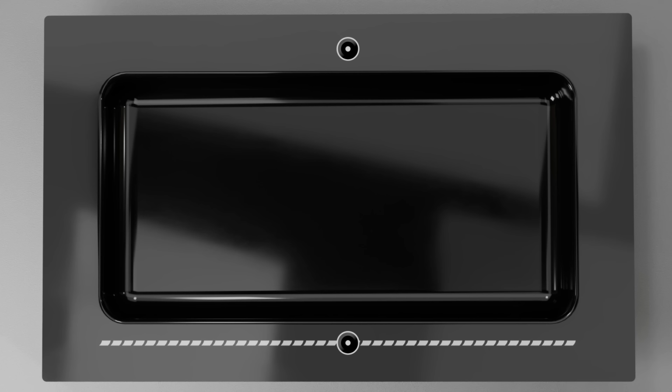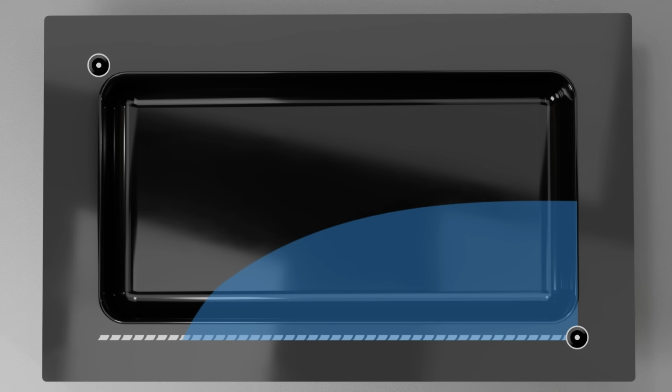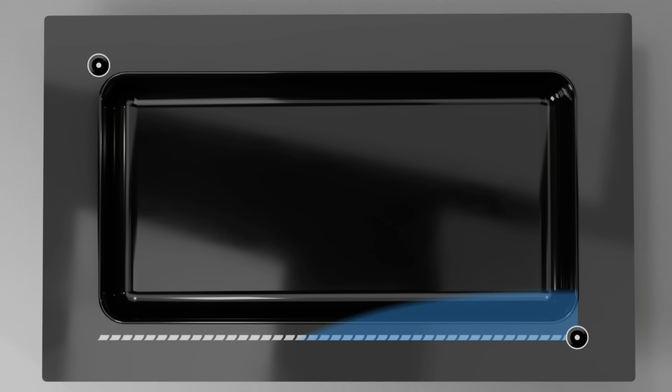By positioning the inlet and vacuum connections at opposite corners, the flow will now reach the vacuum connection last. And so that gives us our second rule. Position the vacuum connection at the furthest possible point from both the spiral and the resin inlet. So in this layout, it would definitely be functional, but can we improve it?